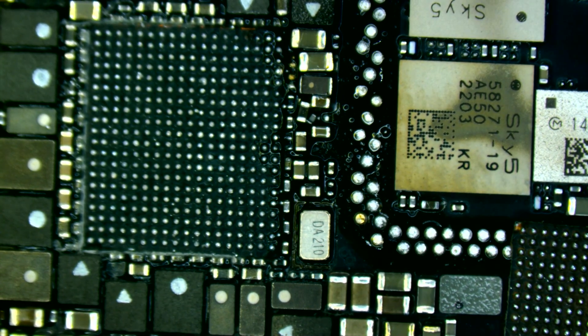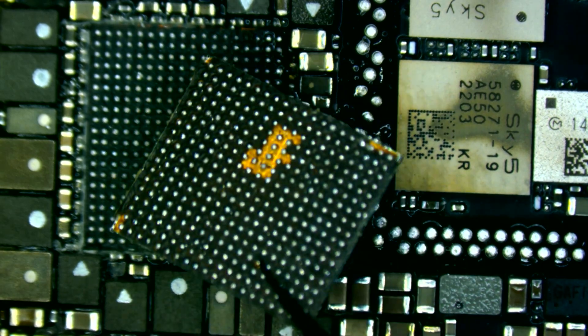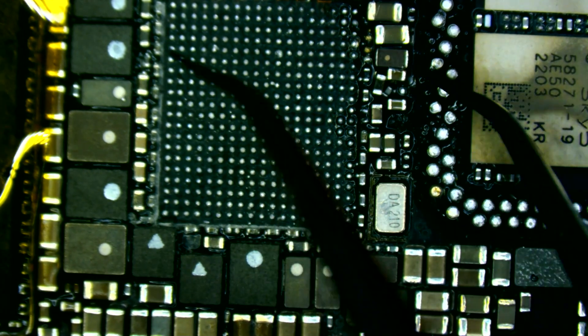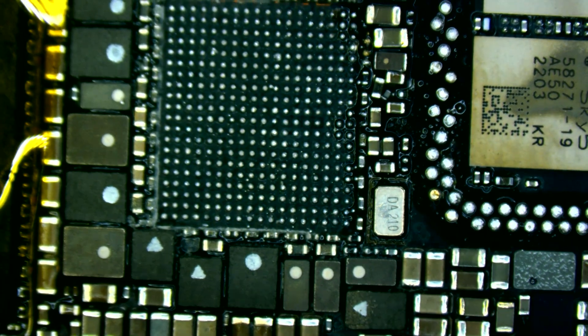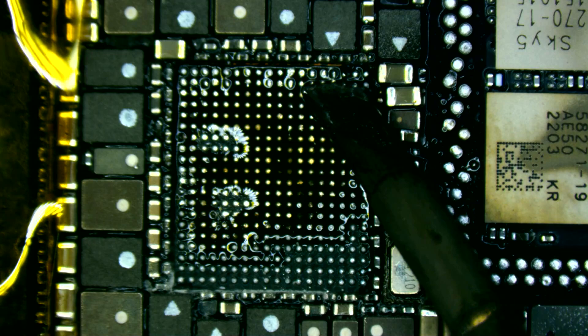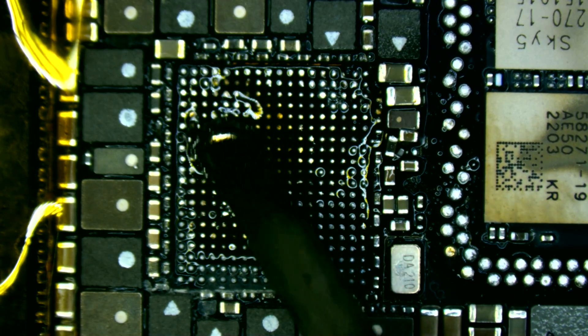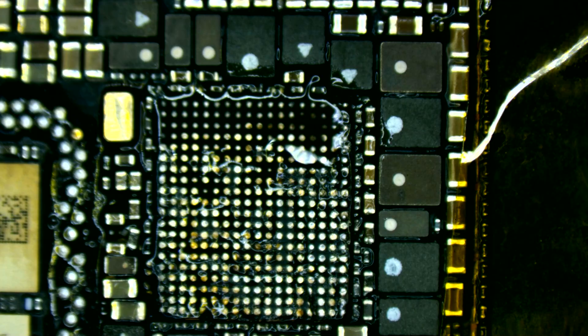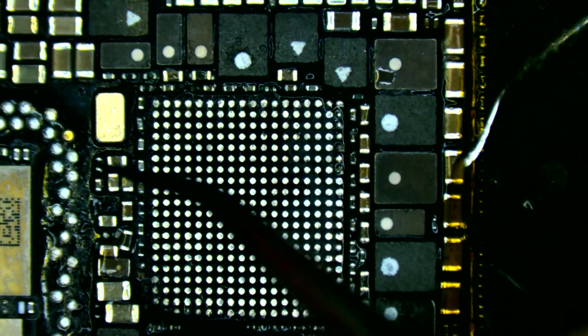With enough patience all of this can be corrected. One of the things you need to focus on is prepping the motherboard to receive the new IC or a reballed IC. The easiest way to do this is to add low melt solder, like a 138 solder, to all of the solder joints on the motherboard. The solder will mix, creating a lower melting point from the factory solder so that it's easier to wick. You also need to make sure the underfill around the perimeter of where the IC is going is clear all the way from corner to corner.